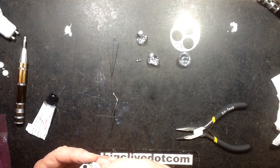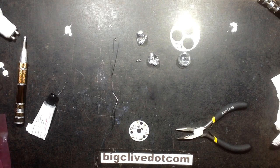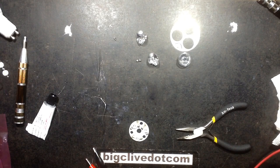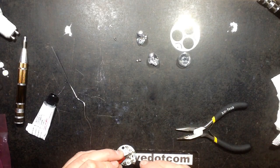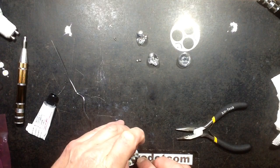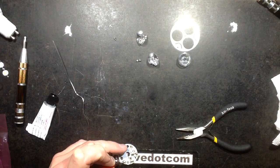So I'm going to stick this back into the light. I could test it, you know, I could actually get my bench meter here and I could stick it to about 9 volts and current limit. So let's actually just go below, let's go to about 6 volts, and I'll just tack it on to there and there, and I can see all the LEDs glowing very dimly. I'll just turn the voltage up a wee tad.